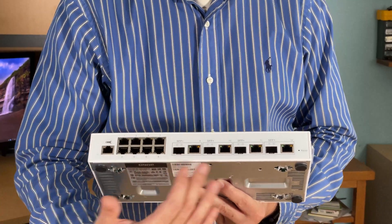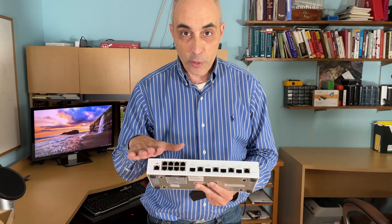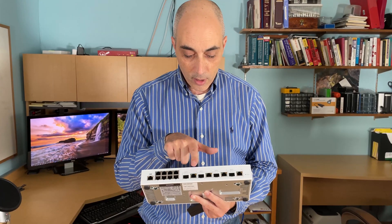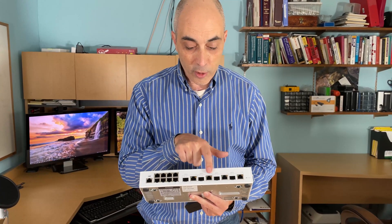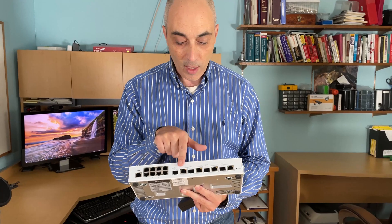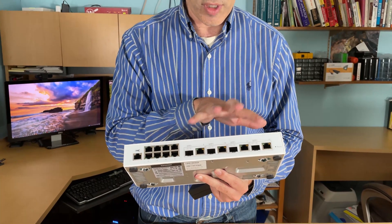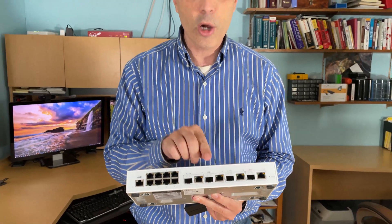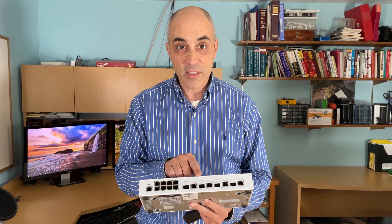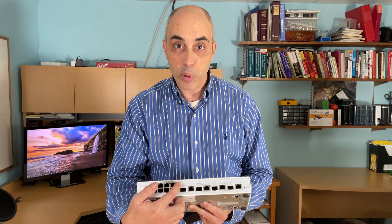What's interesting is this portion of the switch. There are a few other models like this — some come with what looks like traditional gigabit plugs, but these are actually for 10 gigabits, and you've got some with fewer ports. This is the maximum number of ports, which is four — four gigabit copper referred to as 10GBase-T — and the other ones here are SFP+.